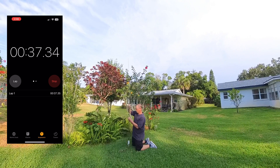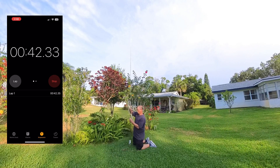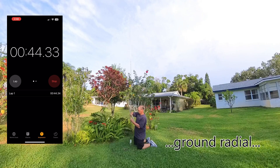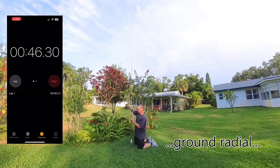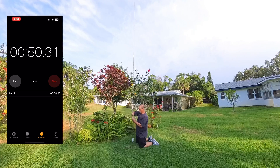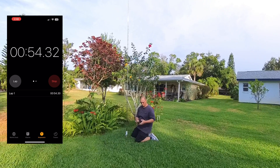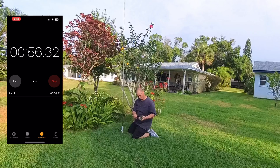Once I get that 17-foot telescoping antenna up in the air, we'll take that 60-foot antenna wire and convert it over to a counterpoise. We'll wrap 25 feet of that out across the surface of the ground, and next thing you know, we've got a multi-purpose wire that we can use as an antenna or as a counterpoise.